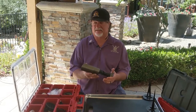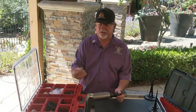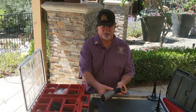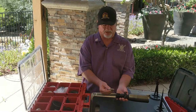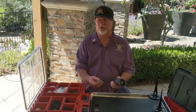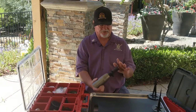We also give you two standoff screws, which is really important because trees grow outward. If I put the fixture right here, it's always going to be at this position, but the tree grows this way. I want to make sure I use something that can stand the tree off — the lag goes on the inside and then this goes into the bracket. You can see it would stand off from the tree a good inch to inch-and-a-quarter, giving you years and years without required maintenance.